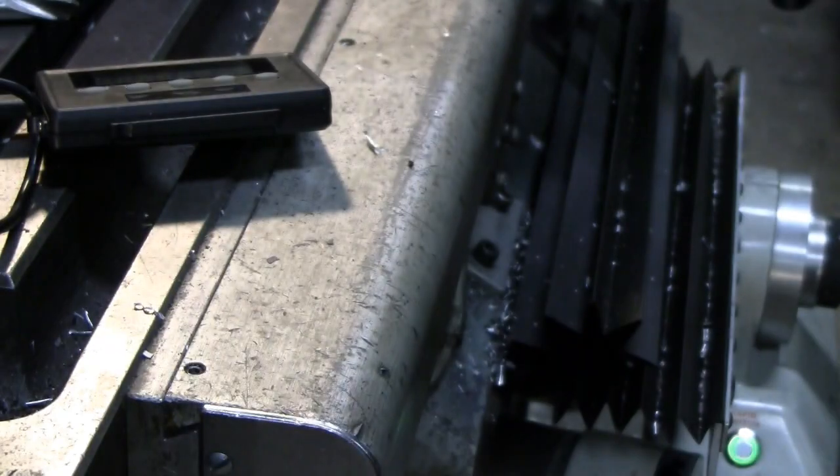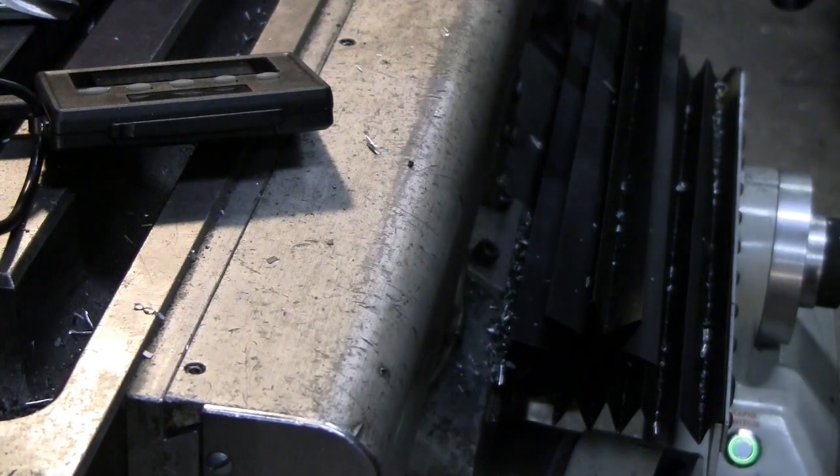399. Now this is not a surface grinder where I'm after tenths accuracy on the Z axis. If I can get plus or minus a thousandth when I come back up and down, I'm going to be really happy with that.